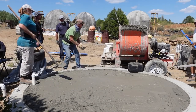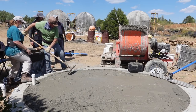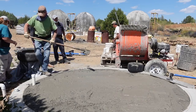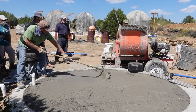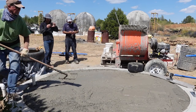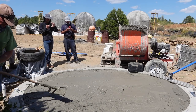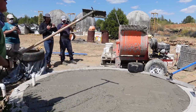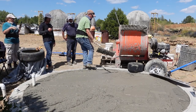Here we've just finished pouring aircrete into this slab — this is our aircrete slab. You have a concrete ring beam going all the way around, and we filled it with the aircrete slab. You can see those PVC pipes next to the foot there by the shovel — those are our inflation pipes. There's one on the outside where the blower gets hooked up, then one in the foundation and another on the inside, all for inflating the two air forms. This was the first time I actually did this system and it worked really beautifully.